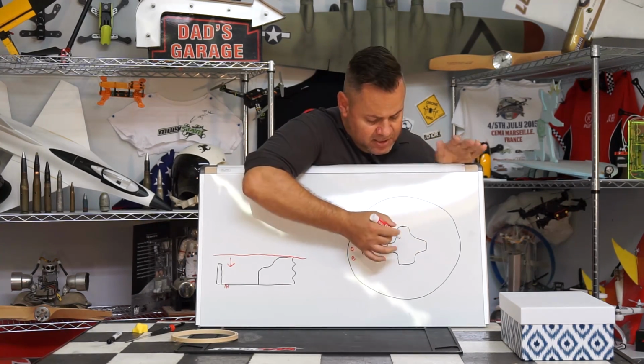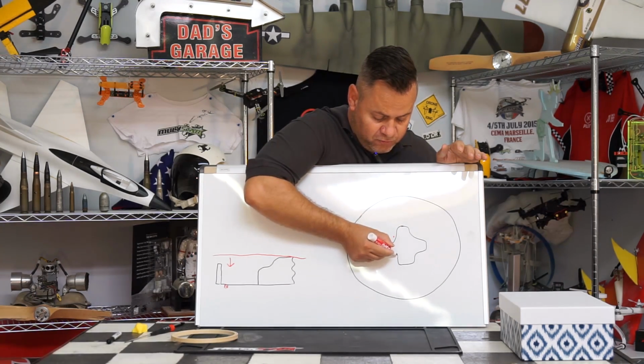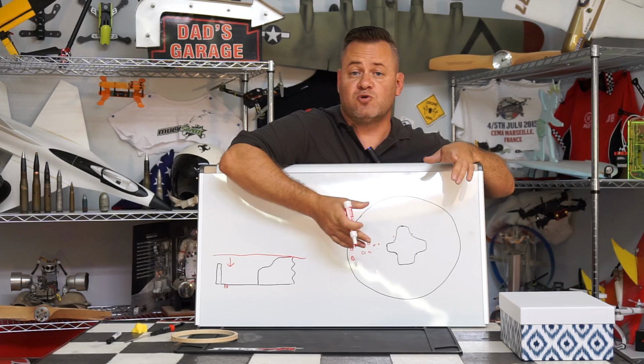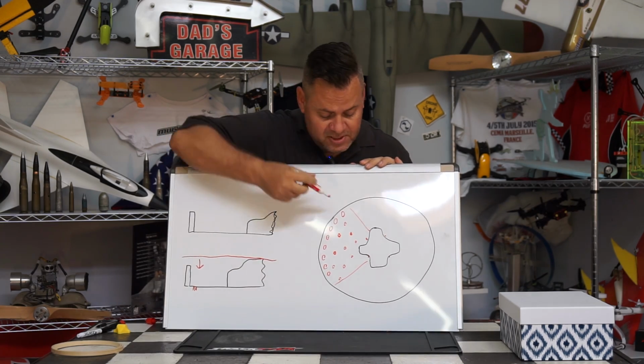So on that pattern. Now right in the mold, because we've got some tight corners coming right on in here, what we want to do is create some holes really close right here in the corners to make sure that the vacuum draws it in. But they need to be smaller and fewer than on the outside, so it draws it in from the outside first.